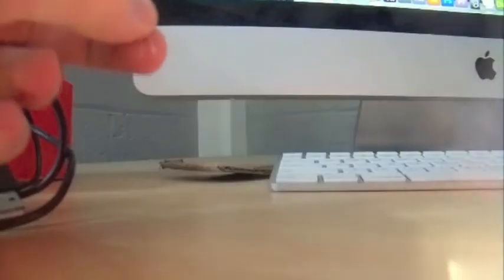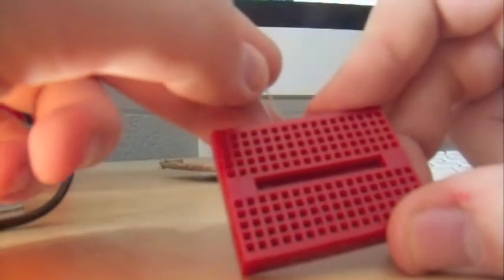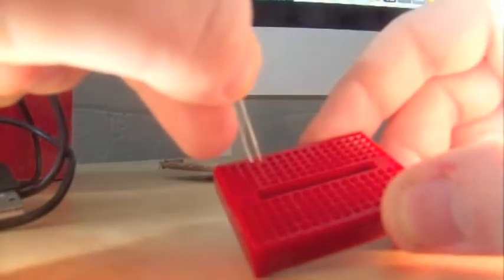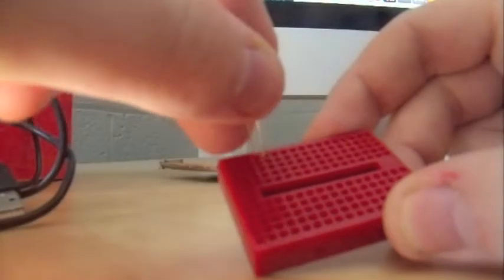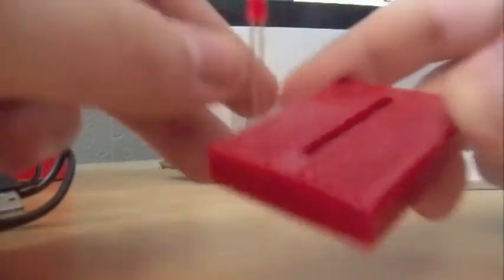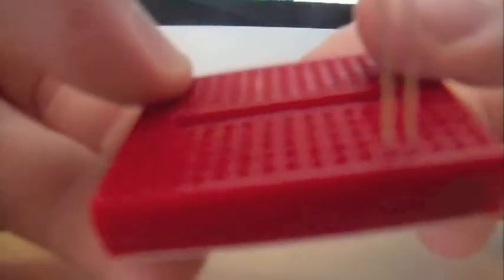The breadboard has columns which are connected to each other. Start by placing one of the LEDs on one end on one side of the breadboard, making sure that you remember which one is the shorter pin and which is the longer. We'll use wires to attach the sensors to the Arduino, placing the wire in the same column as the pin it needs to attach to.